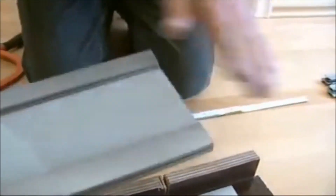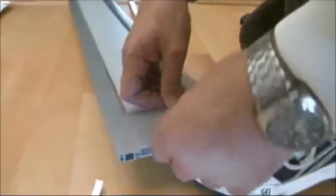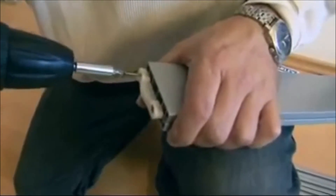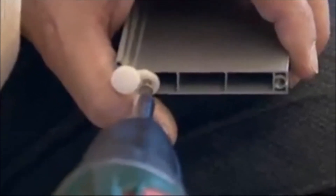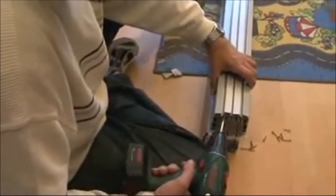The finishing moulding is fastened to the underside of the glass lamella using the double-sided adhesive tape. Screw the initial slide into the lock section. The angle slide is screwed onto the half lamella. The folding door can now be pushed together. Now the pivot moulding can be screwed into place on the top and bottom.